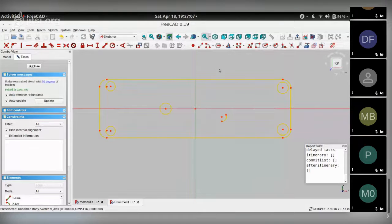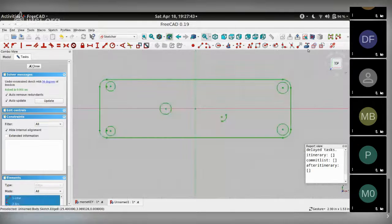There's also two things to note over here. When you see a line that is shown yellow like you do now, it's actually a sketch line. But there's also a way to introduce what are known as construction or helper items that are not actually part of the sketch, but can be used for dimensioning or placement purposes. So in our case, all of these items we see here are actually going to be just placeholders for the other things we want to do in the enclosure. So I'm going to select all of them and change them into construction lines.